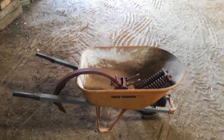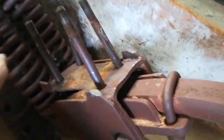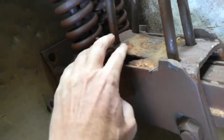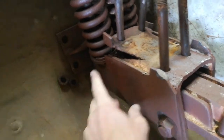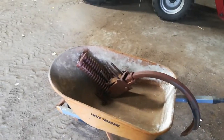Here's part two. You can see this right here — when this shank sprung up against these springs and levered out of the ground, it just tore this apart. This should be attached right here, all together. So I'm going to disassemble the whole thing, get this hot, bend it back where it should be, weld some plates onto it, and then hopefully bolt the whole thing back on so it functions as it's supposed to.